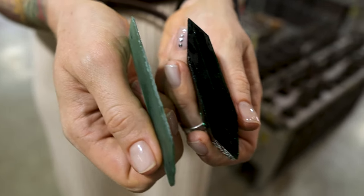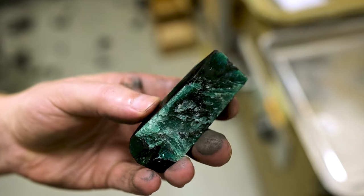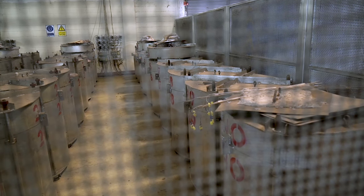There is always a chance that something will go wrong, because we cannot look inside the autoclave and we cannot even look inside the furnace to check how it goes. We can only try to make the perfect environment so everything goes fine, but there is still some chance of mistake. Everything is scheduled, so we know when to open the furnace, but we may get some mistakes — it's like a lottery every time. Sometimes the crystal is too thin, sometimes it's not fully grown, and sometimes we still have some natural emerald on the bottom of the autoclave that hasn't dissolved totally.